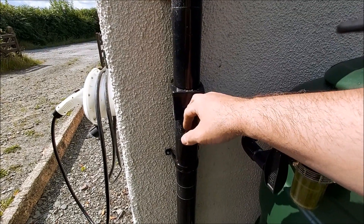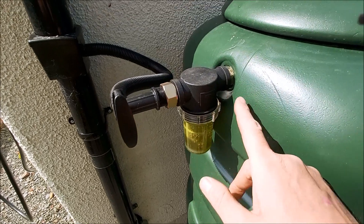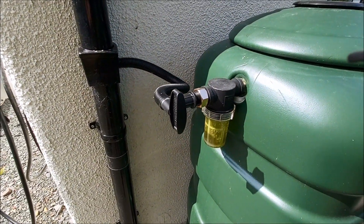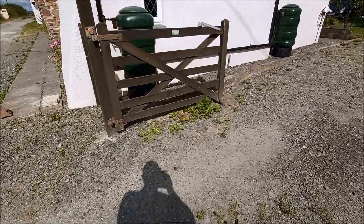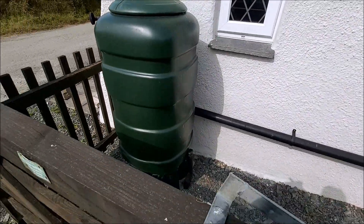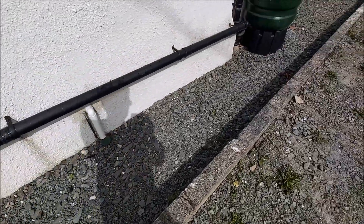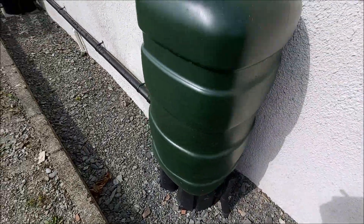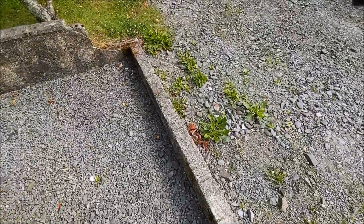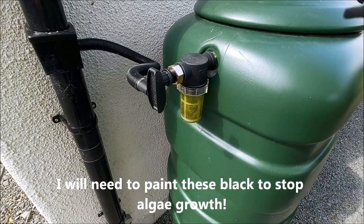This pipe will be connected to the bottom of the hopper, through a coarse mesh filter into the rainwater butt. When this is full it'll just overflow and wash itself back out. At the moment this is my rainwater system - we've got these coarse filters and a 250-litre tank with a piece of 25mm polythene pipe that comes along and links to this one. There's another connection to the downpipe with a coarse filter, and that plastic pipe carries on underground to another rainwater butt with another coarse filter and collection point.